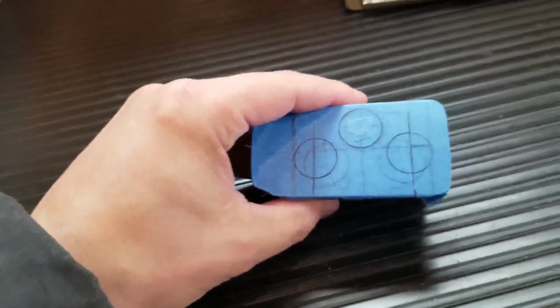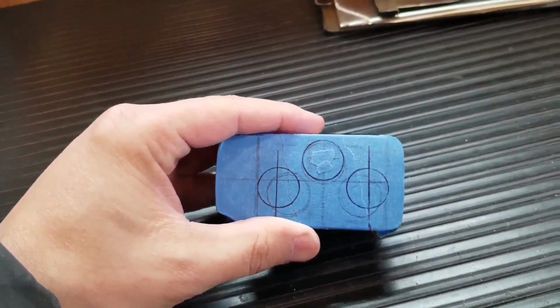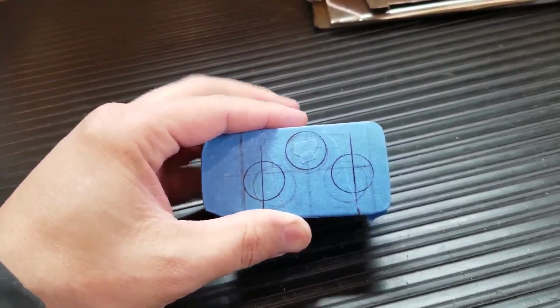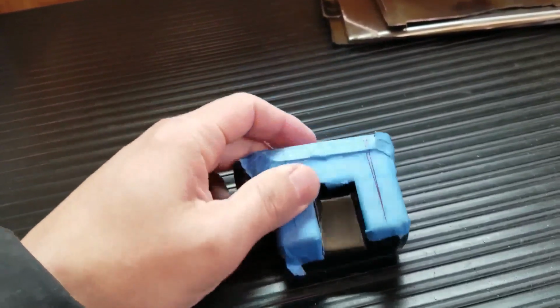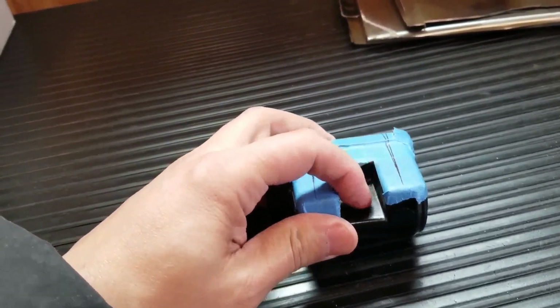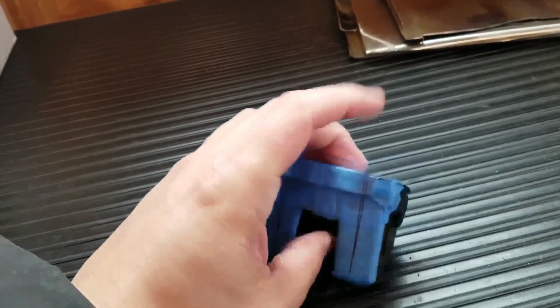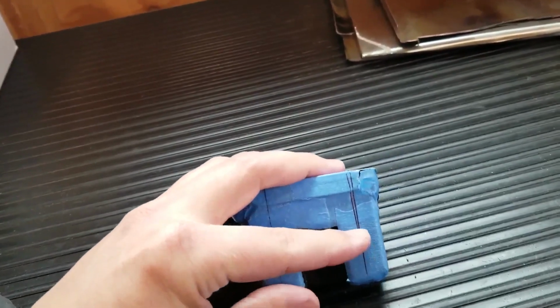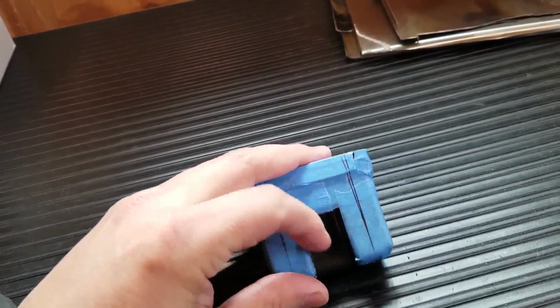Okay, so let's get back to this. That's how I'm going to set it up. I've got 3 switches, and that's where they have to be positioned. I would have liked to put 1 down here and then 2 up top, but it doesn't work because you got this indentation, this valley here, and the switches will come back to at least here. And then you have to solder the wire on, so you need like at least that much space.